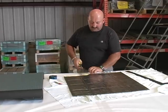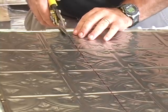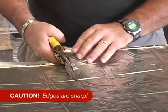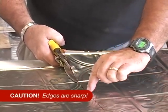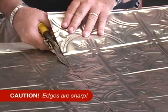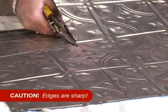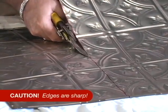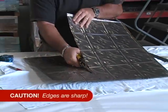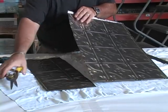The first cut we're going to make is with the tin snips. You've got your line marked. You always want to try to cut on the outside of your mark, and the point of your shear should always be following the outside of your mark. That ensures that you're cutting on the outside of the line. As you're cutting, pull up on the piece that you're going to keep, which is the 15 and a quarter. And you've got it cut.